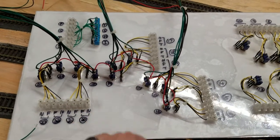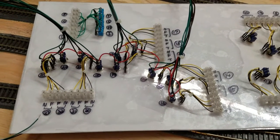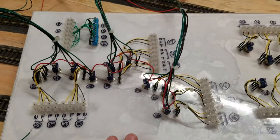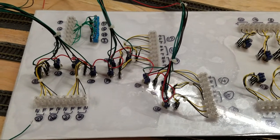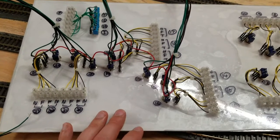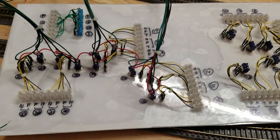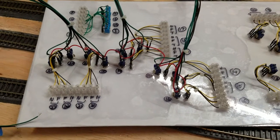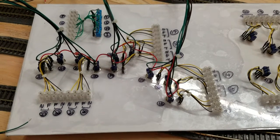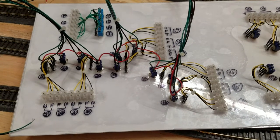It's getting very busy here — once you've got all the common powers running through it, then the wires coming off for the actual toggle switches, and then the LEDs, it's very, very busy. I want to make sure I can correct any problems before mounting the panel in place, because at that point there's no way I'm really going to be able to do any soldering under here, and I don't want to have to unscrew dozens of cables running into connector blocks. So I'm going to start wiring up a couple of the switches to the point motors and the capacitor discharge unit to make sure that's running okay before moving on to the rest.